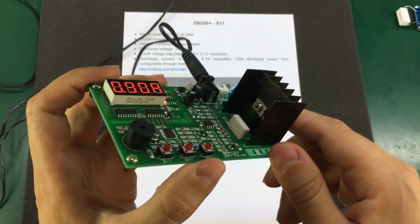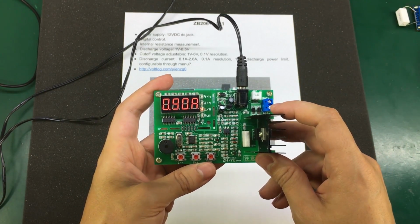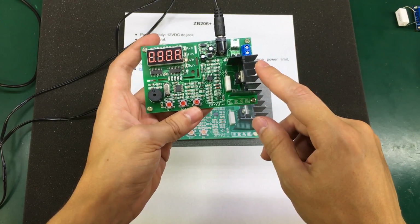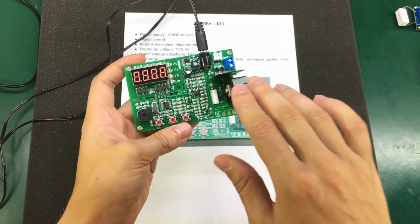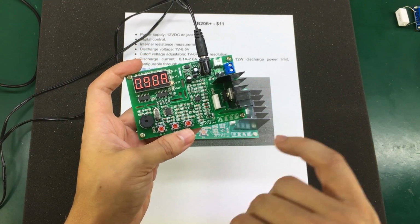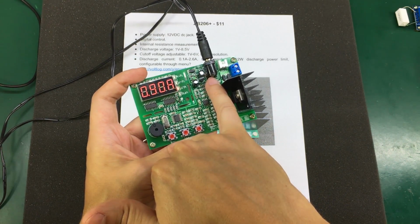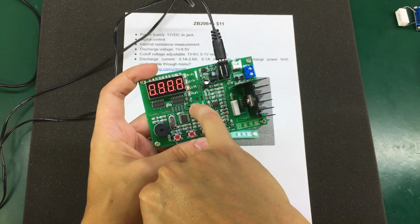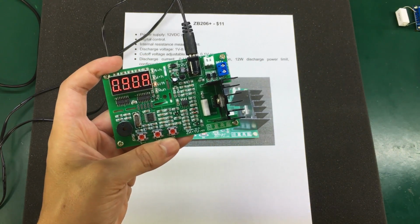Also, there is no temperature sensor on the board to detect when the temperature rises too much, so I would recommend upgrading this to a slightly bigger heatsink and a cooling fan, because there are a couple of points on this PCB designed to connect a 12 volt fan. You will have to take the positive from the center pin of the DC barrel jack and the negative from this point right here marked F-, which is transistor controlled from the onboard microcontroller.